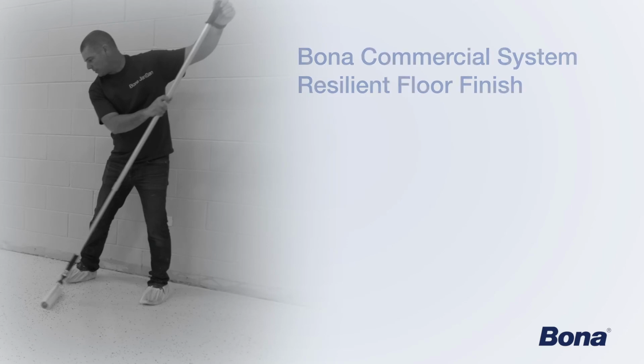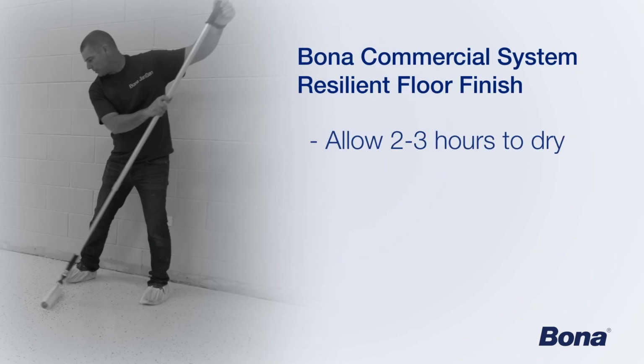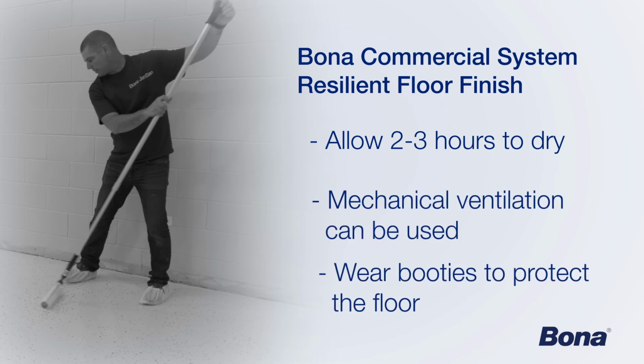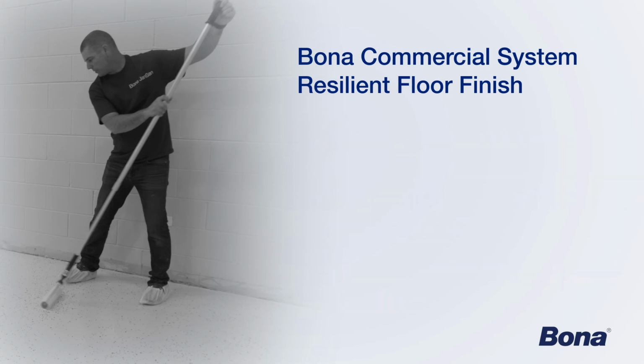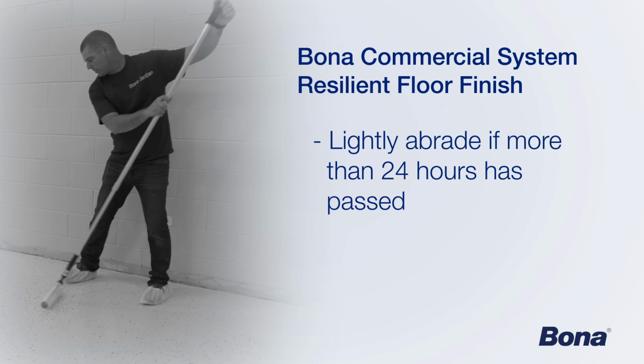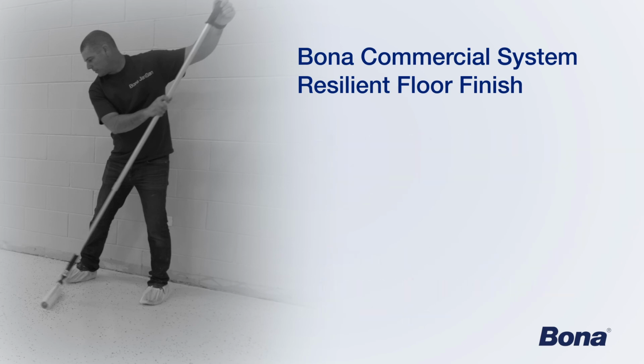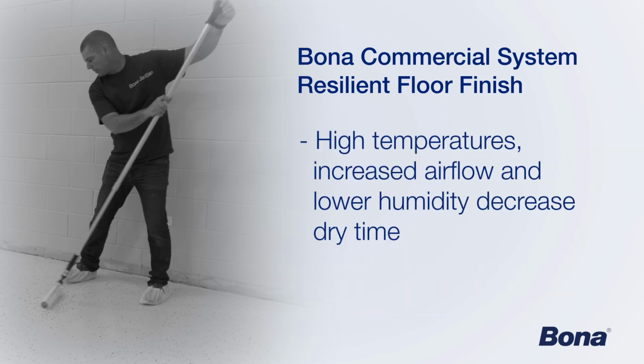Allow the Bona Commercial System Resilient Floor Finish to dry for 2 to 3 hours before applying the second coat. Mechanical ventilation can be used. Be sure to wear booties to avoid leaving any footprints on the floor. If more than 24 hours has passed between coats, lightly abrade using Bona conditioning pads. Remember, higher humidity and cooler temperatures will extend the dry time, while high temperatures, increased airflow, and lower humidity will decrease dry times.